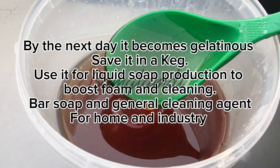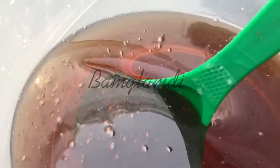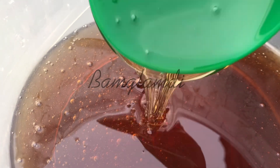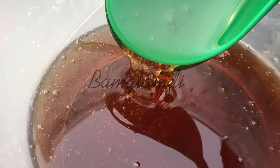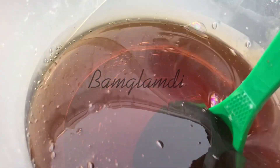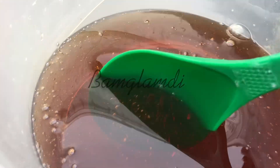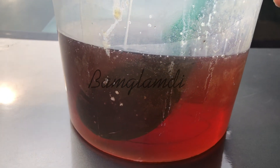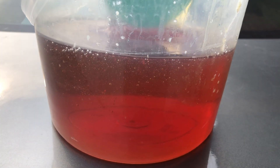The pH of this SDBS matters when you use it to formulate other recipes. For instance, for a dishwashing liquid or multi-purpose soap, the pH of the foaming agent will determine when to introduce it. For liquid soap production, the best point to introduce this foaming agent is to combine it with texapon at the first stage before proceeding with the rest of your production. Adding it at a later stage because of its pH nature may obstruct the production. Sopers can also use this to boost foaming — the outcome is always better than what you've been using before.